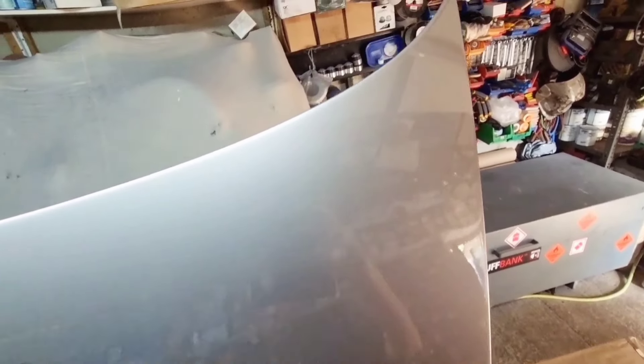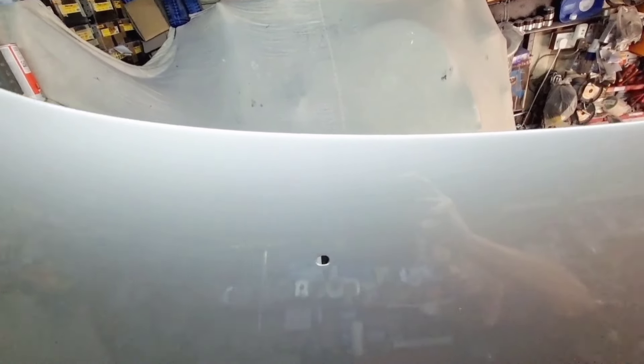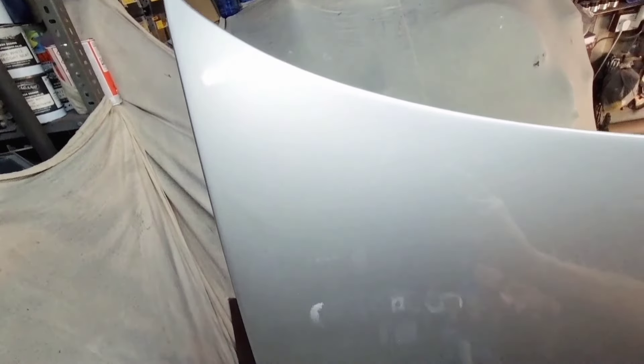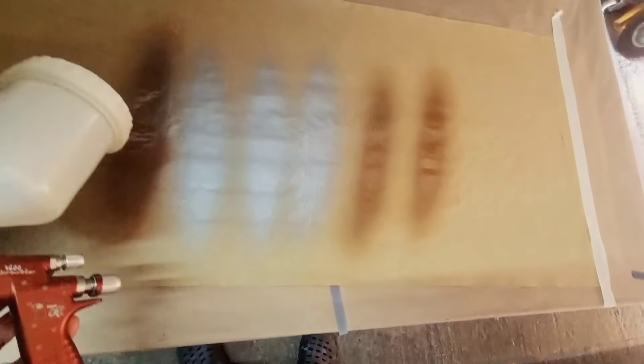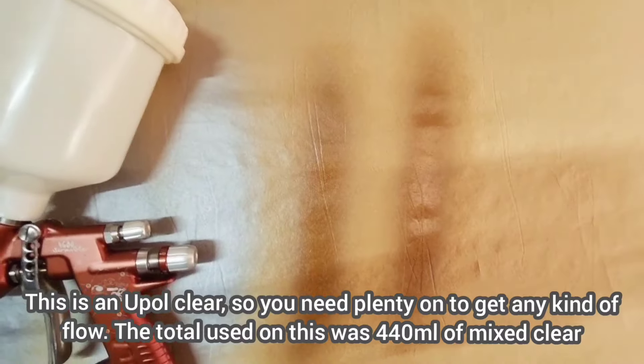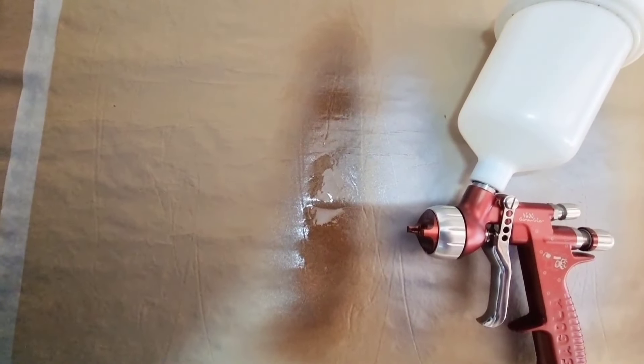As long as you keep those tapered surfaces — inside the gun and on the tip — in good condition and don't drop your tip, you'll get a good seal. I needed to move really quickly because I didn't want a supremely fat flat finish. It came out very very well, exactly what I wanted. If I wanted it slightly flatter, I would have just held the gun up a bit. I had it on full fan, full fluid, and just used speed and distance to get the desired effect.